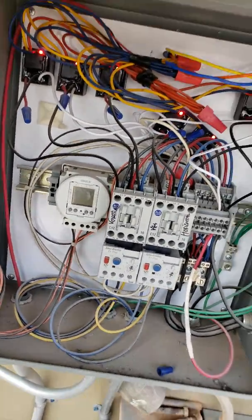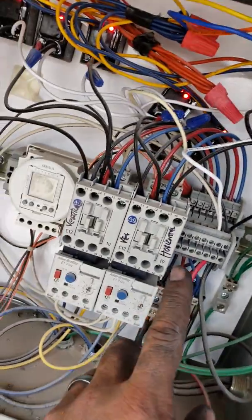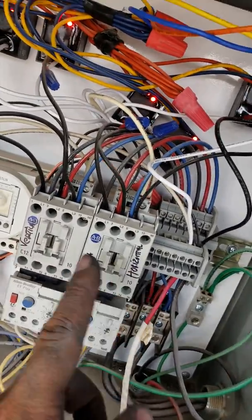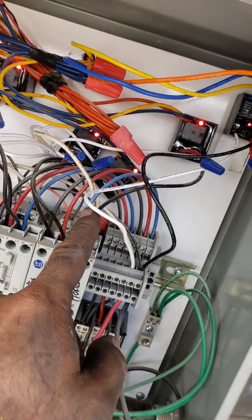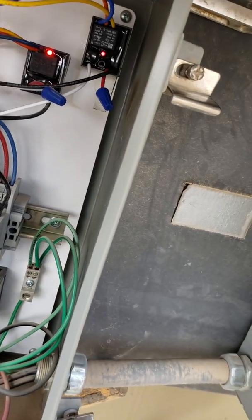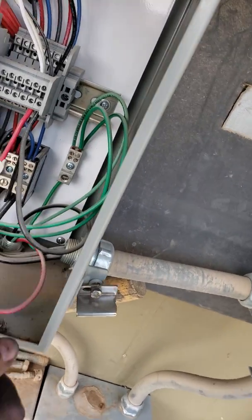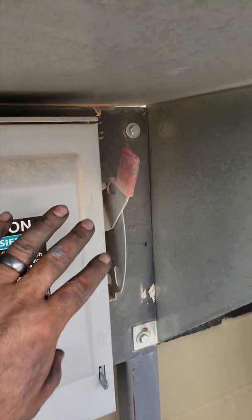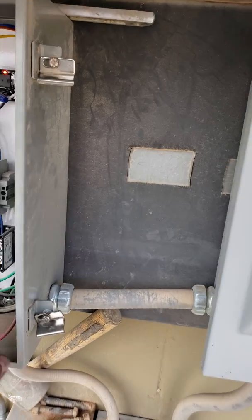And what I'm doing, I'm supervising power to each of the legs. So you can see I got this guy labeled as the horizontal motor. It's a vertical motor. So you have black, red, blue coming in from a breaker. Okay, coming from the breaker. And so power comes in. This is your lockout tag out point right here. So you kill the power here.